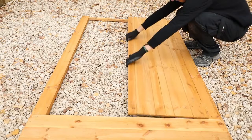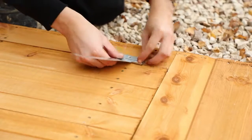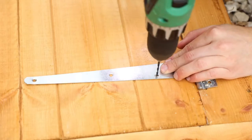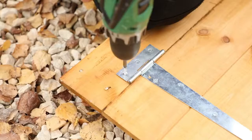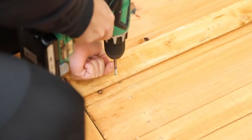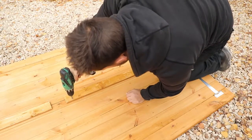Lay the door panel down before inserting the two doors in the opening. Place the hinges over the joint, aligning the screw holes with the framing nails at the top and bottom of the door. Use a 2mm drill bit to pre-drill through the hinge holes before securing in place with screws. Repeat this for all four hinges. Place the door cover trims over the joint before securing them with screws into the master door, leaving a gap in the middle for the lock.